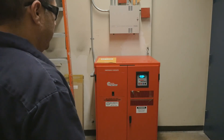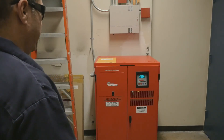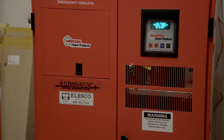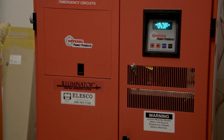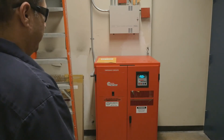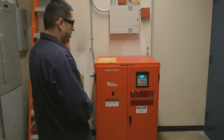As referenced before, the unit has many alarms it can store in its database. Two alarms should be checked immediately if they occur: one is runtime, the other is overload. Those two alarms are self-latching and the unit has to be reset in order to clear them, because if there is a power outage after those alarms have been latched in, your load will be dropped the moment the unit inverts. To reset the unit, you have to follow the procedure to bring the unit offline and back online.